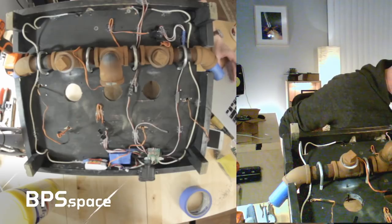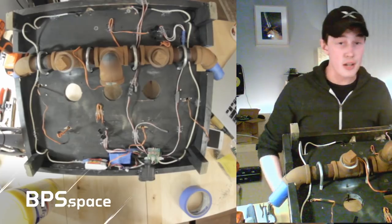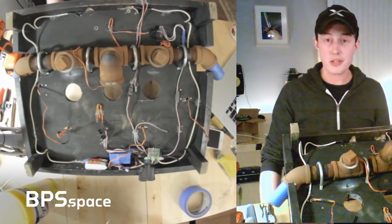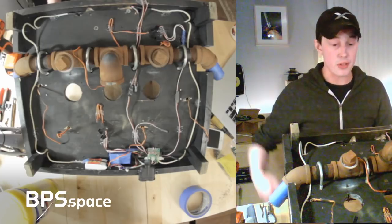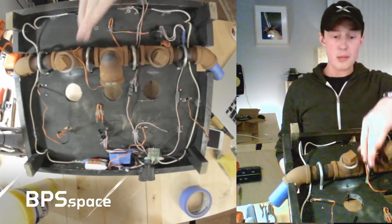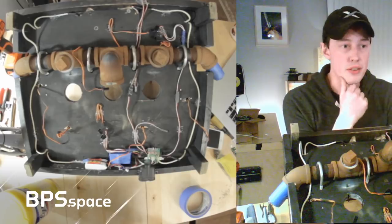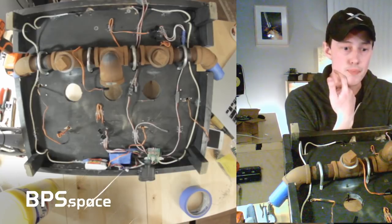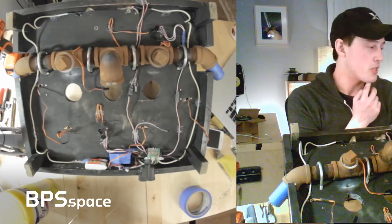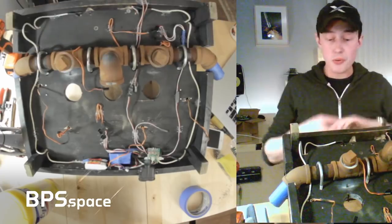I am making my own thrust vectoring system. Can I use an Arduino Uno instead of the kit with the shield? Because the kit costs about 30,000 Indian rupees. I do not know how the conversion rate works there, but you can make your own thrust vectoring system with Arduino or any other platform that you want to use. It's just very difficult to do. Yeah, you can totally do that with Arduino. We're building the Landing Model Rocket series with Blip and Blop, and they're all based on the Arduino platform. Frankly, I think you could do it, maybe not with an Uno. You could probably do a really simple version with an Uno. You just want faster processing speed, if you can possibly get it. The orientation stuff is where I think most folks will end up struggling. That's where I ended up struggling, for sure.